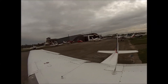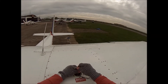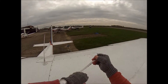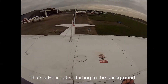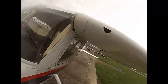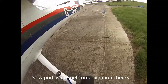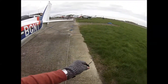Check how much fuel we've got in this tank. We have about 11.5 litres, which is fine — I'm only doing circuits today. Checking all the cowling. Now we need to just check the fuel drain here. Fuel is clear, not contaminated. That's good.